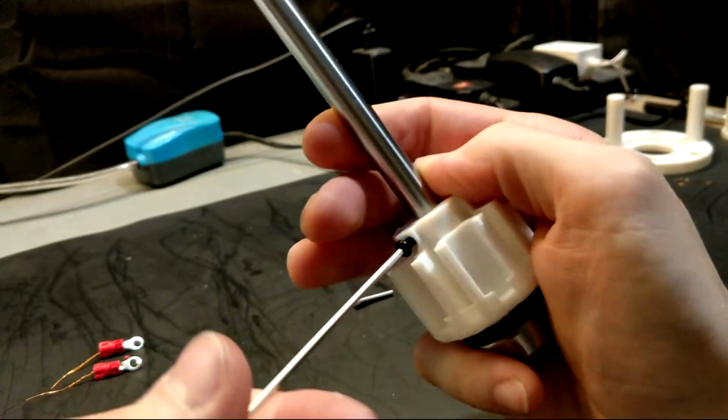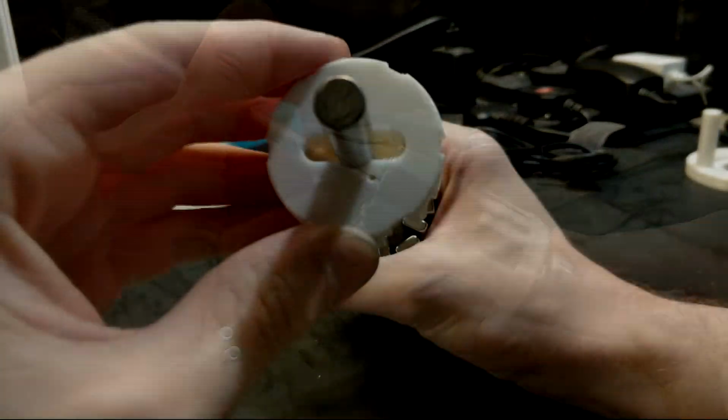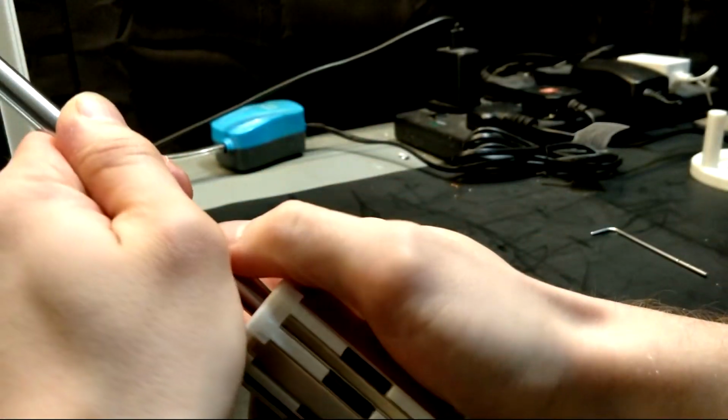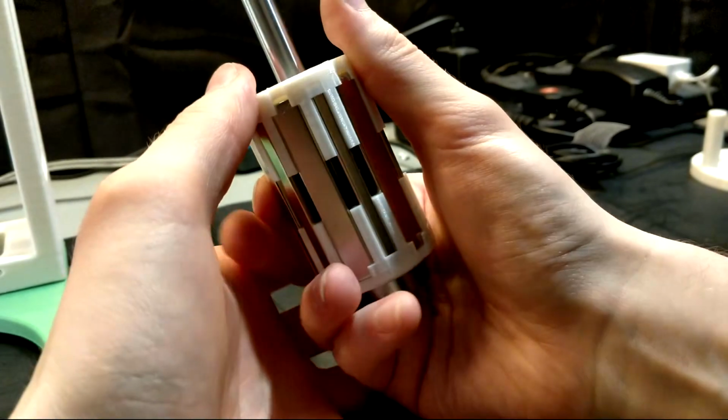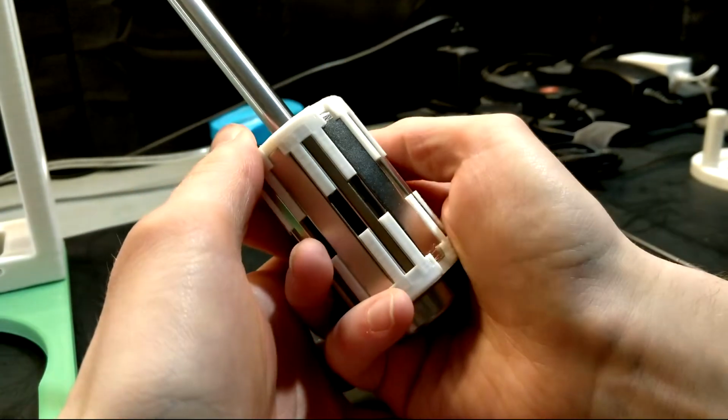After the rotor half is secured and you've inserted the magnets correctly, it's time to grab the other half of the rotor and press the two halves together until they mate. Your rotor should be firmly together, and you want the rotor to be about an inch away from the bottom bearing.